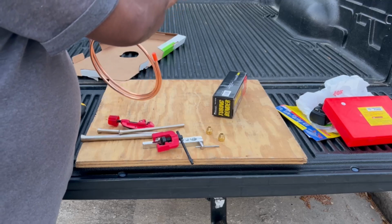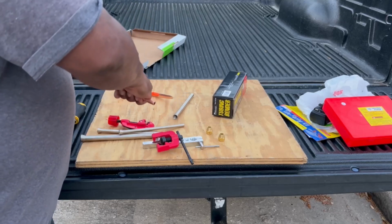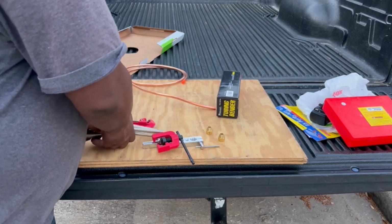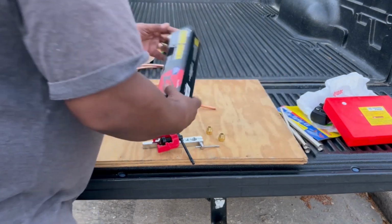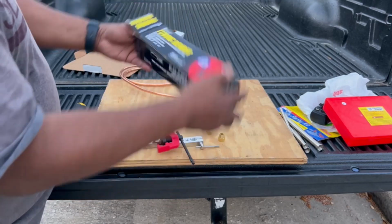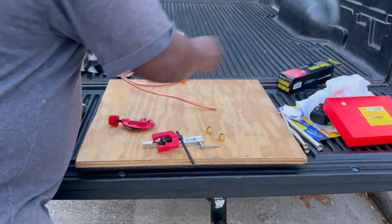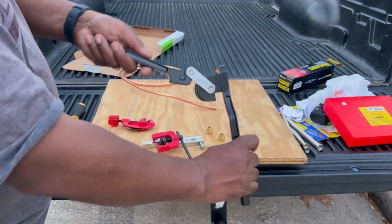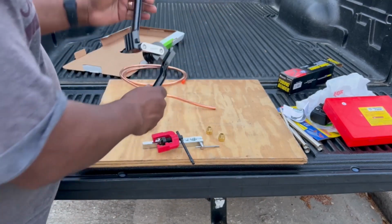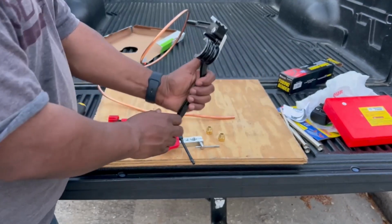But you can buy this little bending tool right here. I got it here on the side in this black and yellow box, and I think it was maybe about $14. But this is what you want right here. So I'll put it in the description if you want to purchase online off Amazon. But you just bend this over and you slide your tubing in, and it has different sizes. Like I said, I'm using 3/8, so I'm gonna slide it in that 3/8 slot.